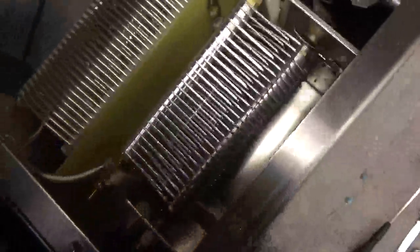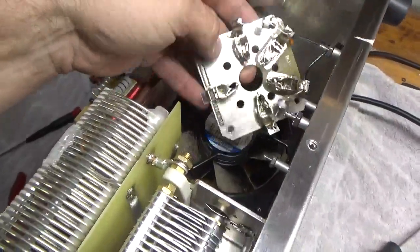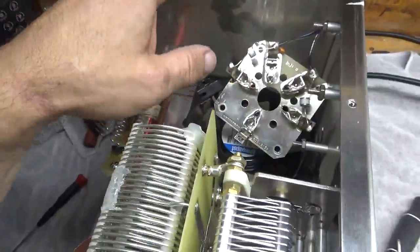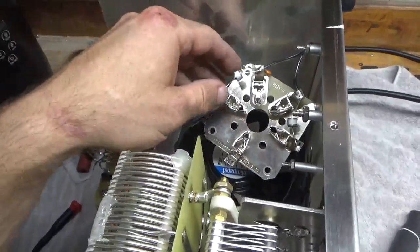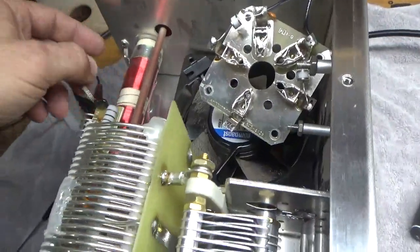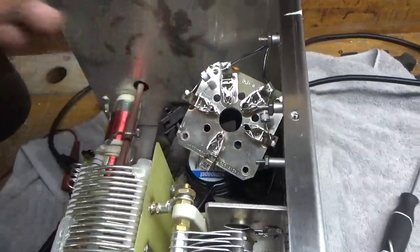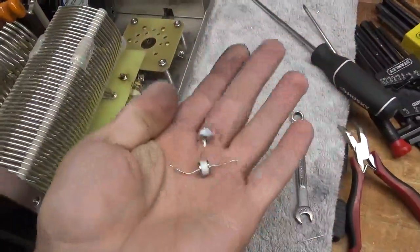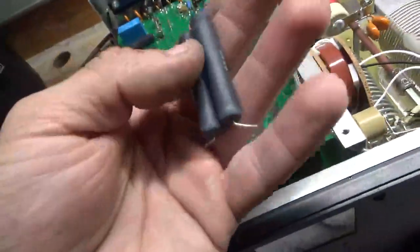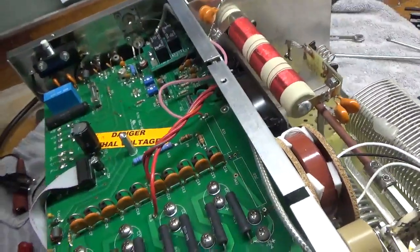I'll be back when the next one's installed. Everything's reinstalled. I took the nuts off and pulled the socket up off the standoffs. I'm going to replace these two gas discharge tubes. The tube probably had a flashover, so I always change them — even if they seem okay, who knows how long before they end up failing due to a fault like that. The old gas discharge tubes have been removed, new ones installed. I removed the old series glitch resistors, cut the lead lengths on the new ones, used the solder sucker, cleaned the holes. Now I will pre-tin the leads and install them.